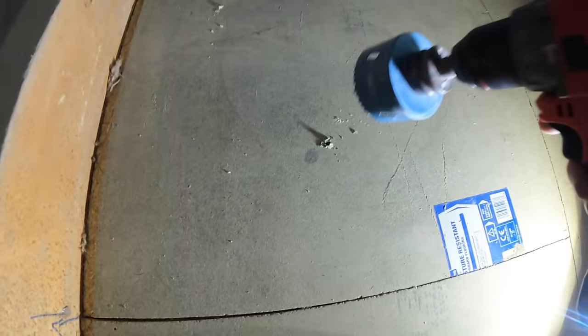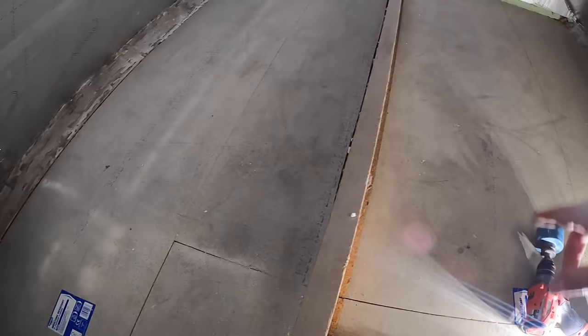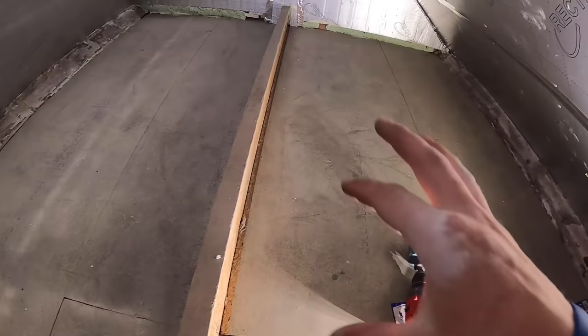And James is below here, waiting for me now to drill out the timber again. Right, mate, are you at that first one? Okay, so all I'm gonna do is, I won't show you this again, we're just gonna drill these out, and then again we're gonna do some clipping, find the center light, pull it up, put another Wago box in, and then this section will be done.